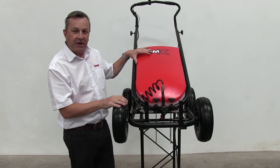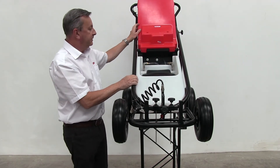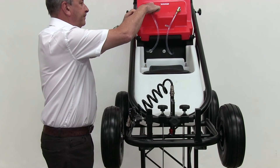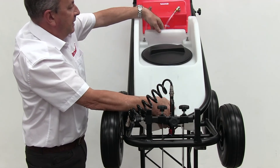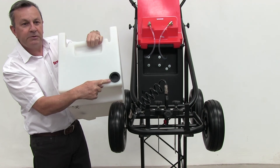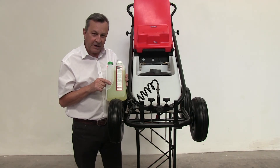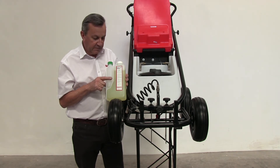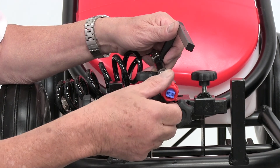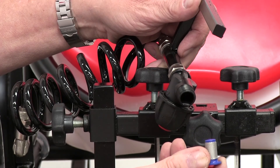We recommend that the GMX has a weekly thorough clean. For this, we drain the paint tank. We remove the two couplers, lifting off the paint tank. We then use the rear drain plug to ensure the paint tank is fully empty. We then partially fill the paint tank with a diluted solution of multi-flush using the prescribed measure. The final part of the cleaning is the top hat filter, which is above the nozzle.